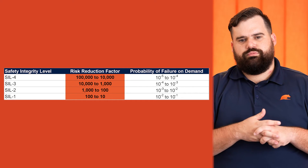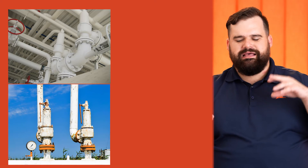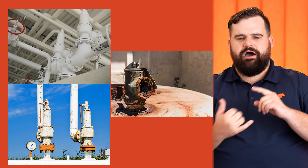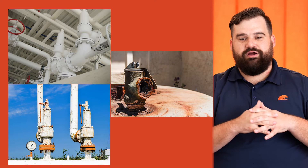Lastly, talking about PM programs — I know we said this is engineered, and the pictures coming up show a mechanical device, but the point applies to all safeguards, instrumentation included. The first picture shows a nice clean, brand-new installed device. The second shows some degradation — paint chipping. The third picture shows an actual failure: a device completely rusted out and plugged, not useful at all.